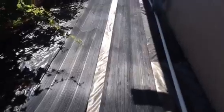As you can see, the flow is pretty substantial through the collectors, and that's one of my problems, because I was going to come in here and go all the way up, back, and all the way back down, and then come out this corner, but I was concerned about flow constriction with just going through one set of panels. So I go through the two sets of panels. I'm not putting a big heavy load on my pump, as you see.